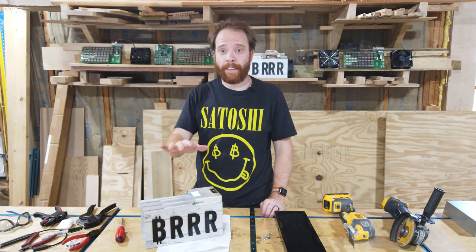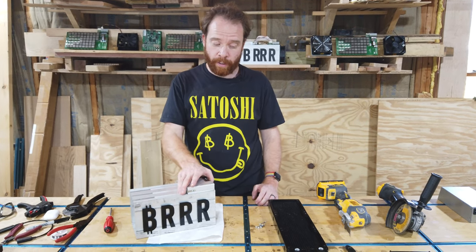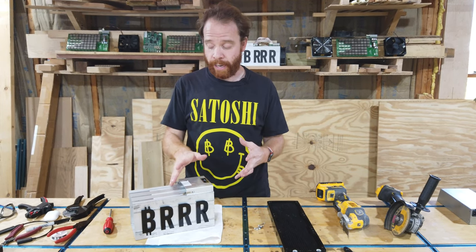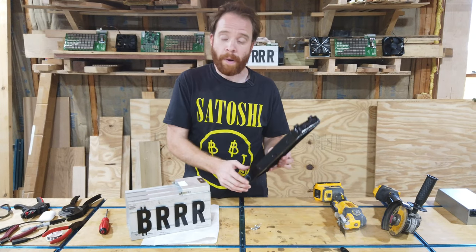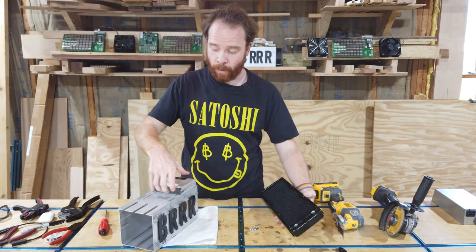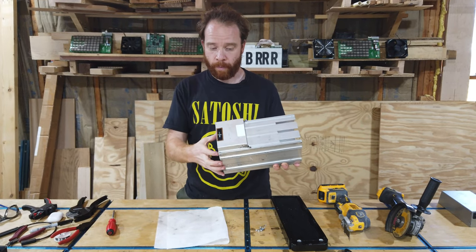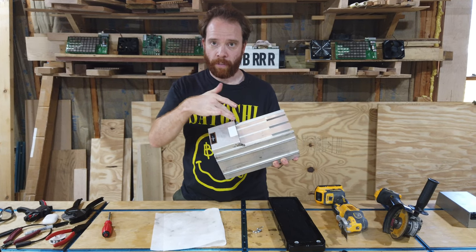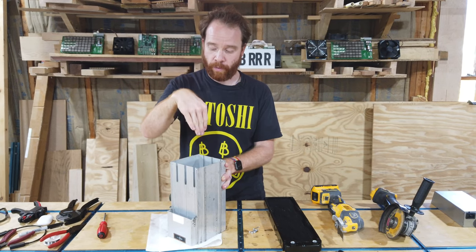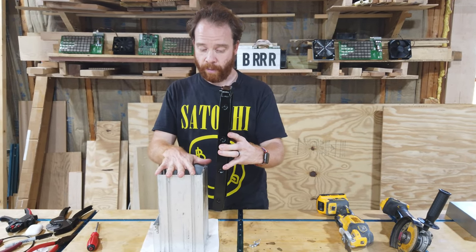All right, so now that our S9s are clean, we can start building. Like we mentioned at the beginning, we looked for solutions that make the whole build extremely simple and easy for anybody to do. Now, what we need to do is mount our radiator to this S9 casing. Later, we will build the injector plate at the bottom, where the control board also sits, and the top will be where the slots are. That's where the hash boards actually fit in. So we need to find a way to mount the radiator to this casing.